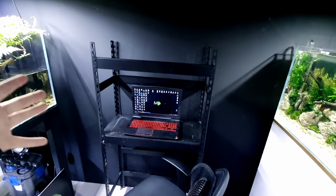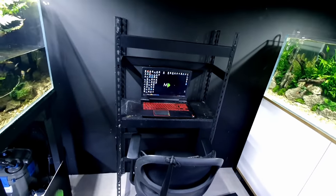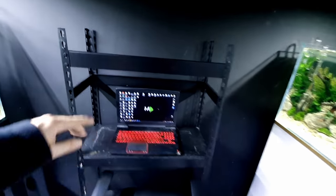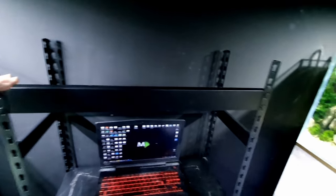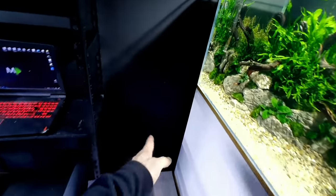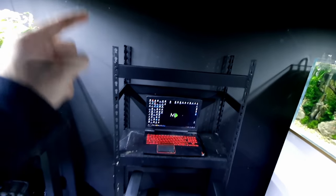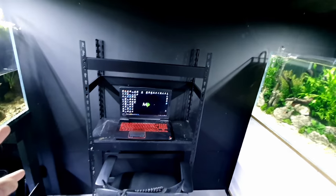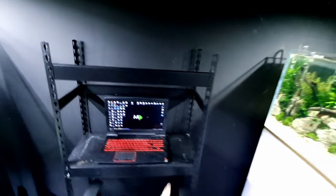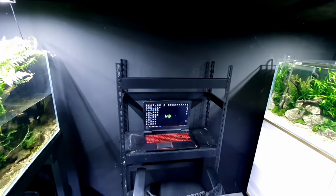Okay, guys, we've got the basic structure in. Look, that works well. Chair goes underneath good, legs underneath. It's now a case of bolstering all up the sides, setting the height of here, so I need to cut these sections off. I can then do a cross member all the way across on the support beams coming down, and then offset one back for more coming up, more going across, you know what I'm saying, like just build around it effectively, but have this as the main shell. I can also just screw this to the back as well, so we're locked in, if you like. Nothing can come forwards, plus then I'll strengthen the struts at the side with some of that really good wood we've got. I think it's 1 inch by 2 inch wood. Let's get on with it.